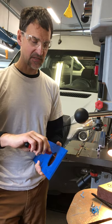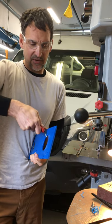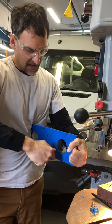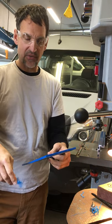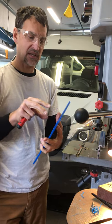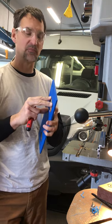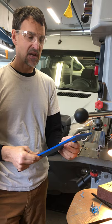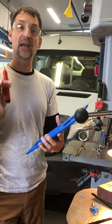But being the perfectionist that I am, I prefer instead to take my countersinking tool and simply go around a few times, keeping the panel really nice and straight and flush, just digging this in. As I do that a few times around, I then go to the other side and do the same thing. By doing so, I've essentially rounded out this hole so that now my water pressure gauge will fit right in nice and flush. I'll just keep trying until it fits just right — I don't even necessarily need the drills on the flange to hold it in, though of course I will install those. That's one way to make a hole just a little bit bigger and also to clean up your edges.